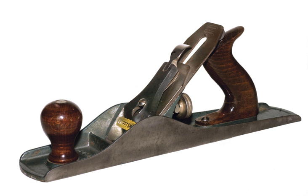Planing across the grain is sometimes called «traverse» or «transverse» planing. Planing the end grain of the board involves different techniques, and frequently different planes designed for working end grain. Block planes and other bevel-up planes are often effective in planing the difficult nature of end grain; these planes are usually designed to use an iron bedded at a low angle, typically about 12 degrees.